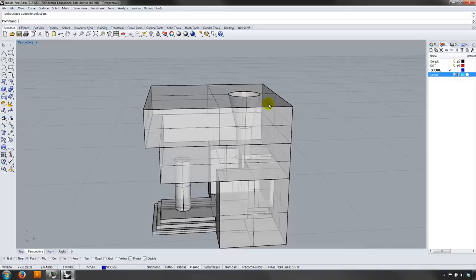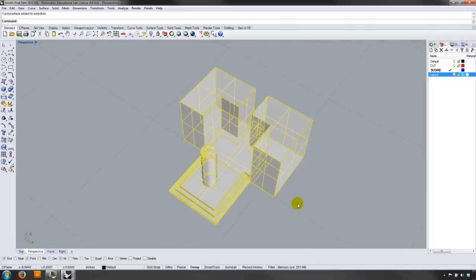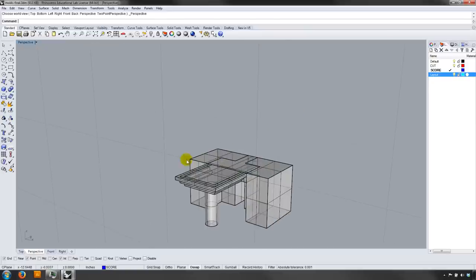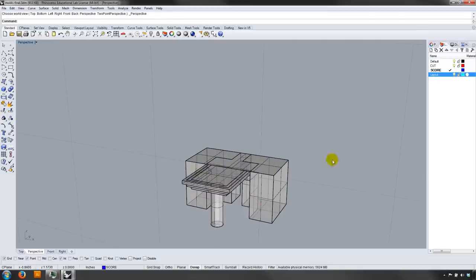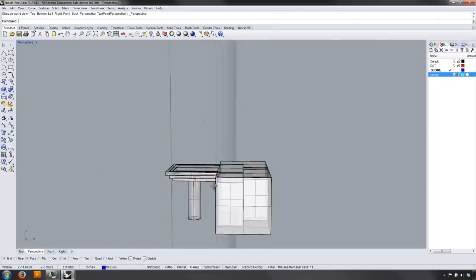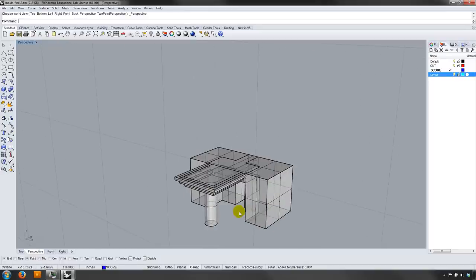So I'm kind of in a pickle — I really have to design my way out of it. The other piece is going to be a little easier because if I flip it upside down, I shouldn't have any real difficulty pouring to get that form. This is actually the way I'd want to do it — upside down. You have to think about the direction carefully. If I pour in, this fills out first, then fills up, and I'll have a nice flat top. I should be able to pop that out with no undercuts. You just have to be careful to make sure the rockite gets all the way down and fills completely — shake the mold a bit to ensure it fills.